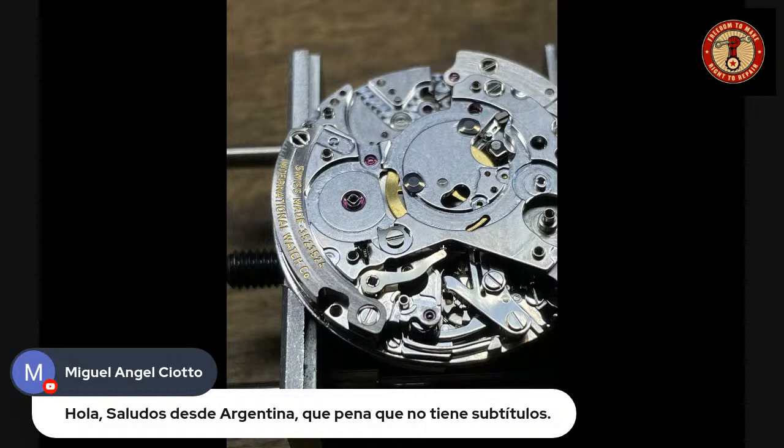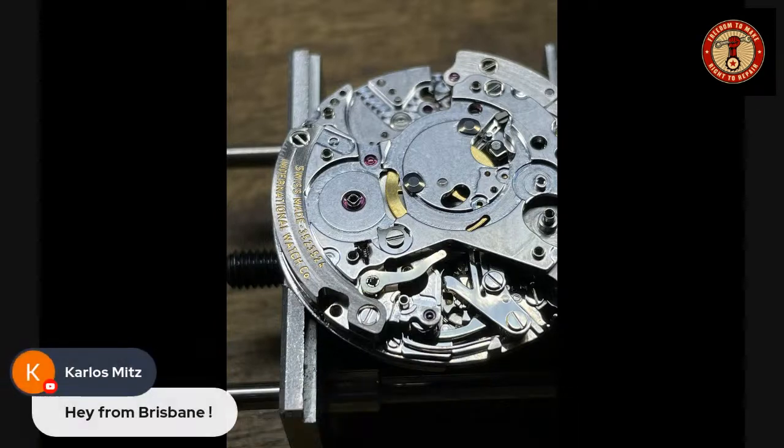And it does the same thing when you stop the chronograph. But the interesting part is where the lever is on this post, you can see there are two cuts, or four slots, in this post here. That screw actually has a tapered shoulder, and the post it's sitting on is kind of like a collet. So as you screw that screw down, it splits apart that post, which puts pressure on the inner diameter of that hole on the lever, and then it locks the lever in place. And that's how you adjust it.